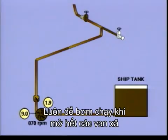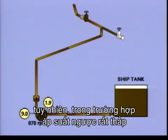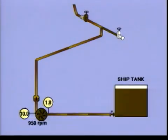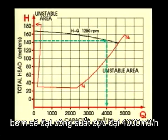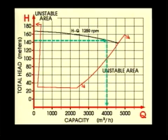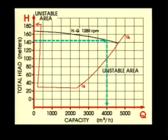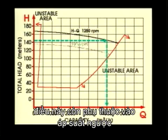Always run the pumps with fully open discharge valves and try to reach full speed. However, in case of very low back pressure, you may be forced to throttle the flow with the discharge valves so the pumps don't run at over capacity. If the head is 145 metres, the pump is giving its maximum capacity of 4,000 cubic metres per hour. If the head is more, the pump gives less; if the head is less, the pump gives more. You should not run pumps over their nominal maximum capacity. It is possible to reach the pump's maximum capacity at a lower speed — it depends on the back pressure.